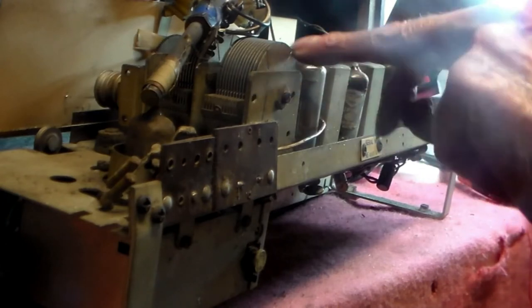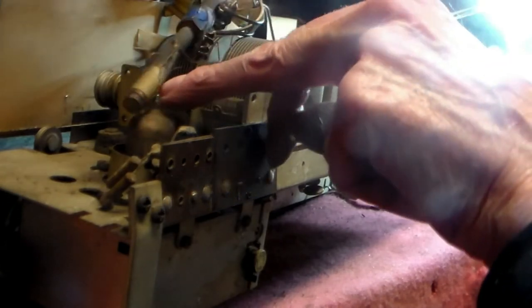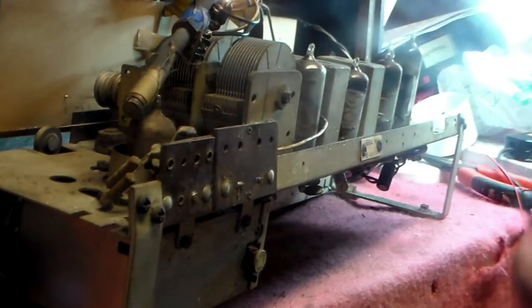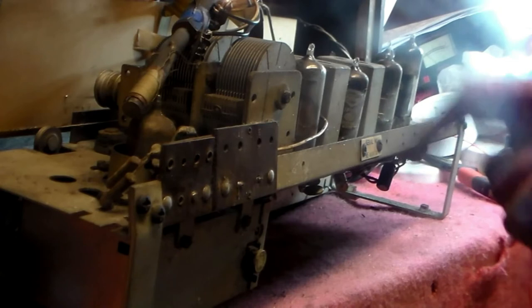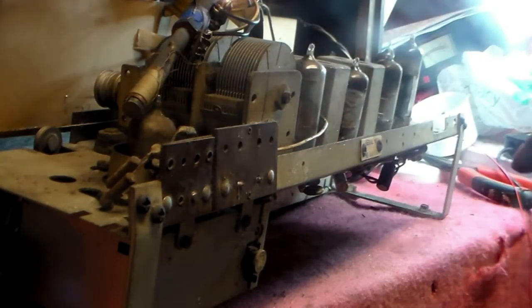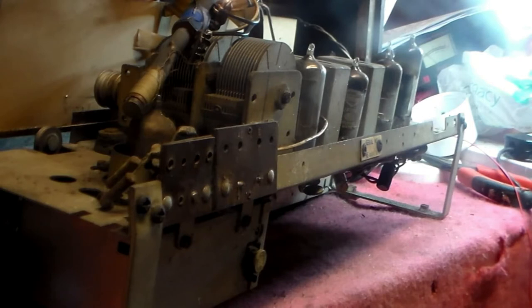Okay, and this little valve here, that is the one which does all the magic for FM. If that works or it doesn't, they're quite easy to get, although one or two of them are getting hard now. Some of them have two UF80s there, of course, but this one has what's called a UCC85. There's also an ECC85 and also a PCC85 for TVs.